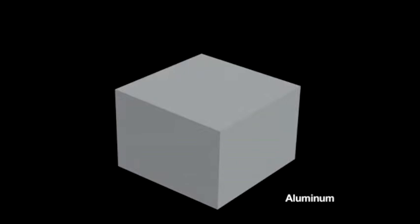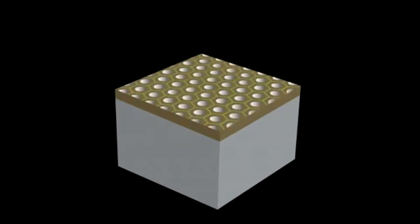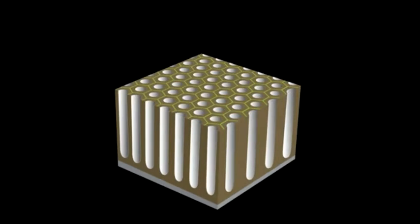Using aluminum as the positive electrode, engineers first pass enough current to grow a thin barrier layer, similar to that which forms naturally. Then, as the anodizing proceeds, the current pushes this barrier deeper down into the aluminum, converting the aluminum above into a very porous oxide layer.